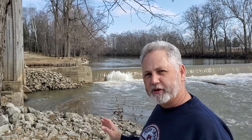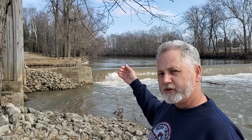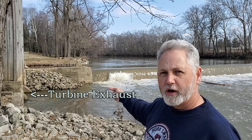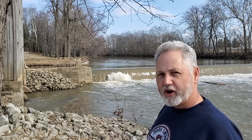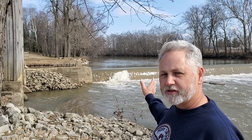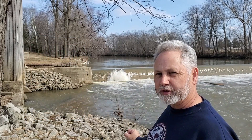This is a very good example of a mill dam — what's used to back up enough water for the mill to operate. We talked about the race or chase on the other side that lets water into the mill, and right down here you can see where the water comes out of the bottom side of the turbine after the energy has been produced. This mill at one time had an overshot wheel, and this is probably the foundation that the wheel was attached to on the side — they changed that out about 1909. It's very dangerous to swim around one of these, as the undertow on the bottom side of the dam is very dangerous — easy to get caught in and not be able to get yourself out.